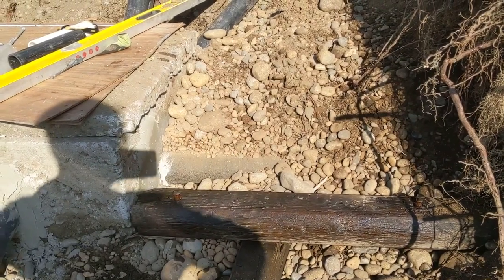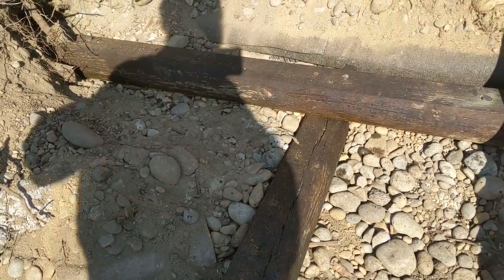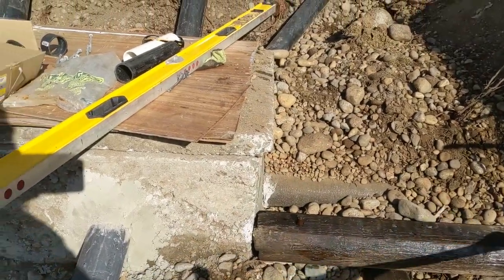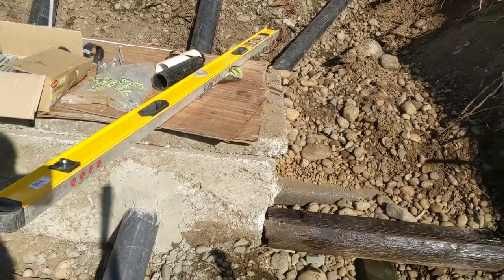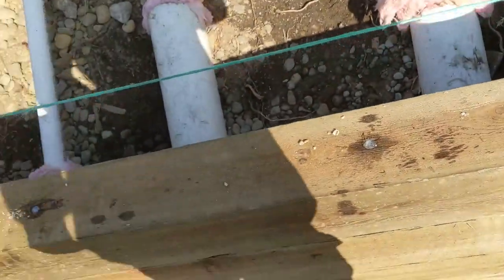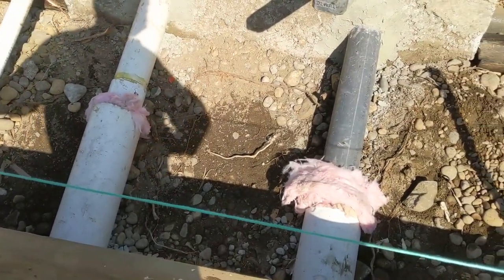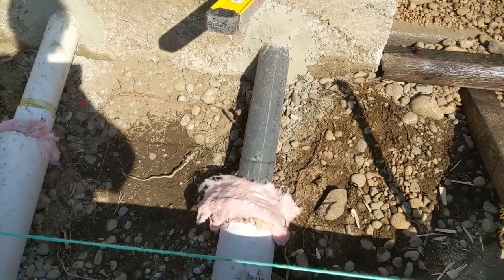Yeah guys, here for my retaining wall — put some braces in there to hold it in place. Again a four feet rebar, like you guys can see in there — this guy here is a four feet rebar going down on both sides, and that would hold the weight of the soil, it would hold it down. Just make a cut that way, once you look from the outside, you don't see the wood passing. All the wall would be clean. Somebody would look at it and say the wall is not braced, but it is braced.